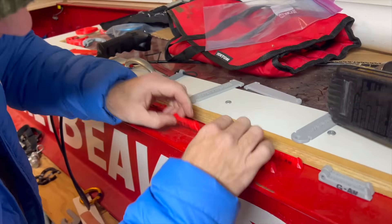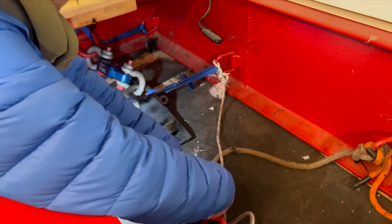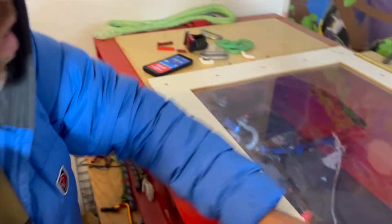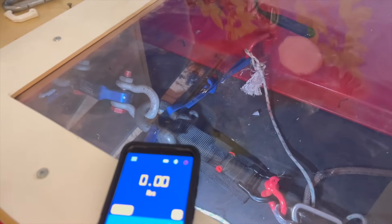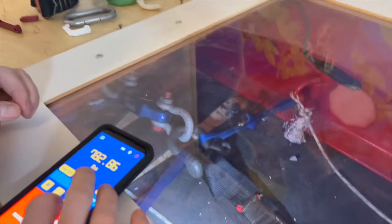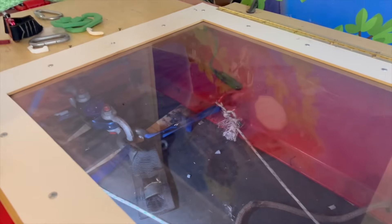Let's do these — these are PET-G, one annealed, one not. I don't know how much longer this is going to remain accurate; we're beating the heck out of the webbing loop here. This loop starts to get opened up and it starts to load these farther out towards the edge, which has more leverage on them. Non-annealed PET-G: 782, basically 800 pounds. So annealing definitely helps the PET-G.